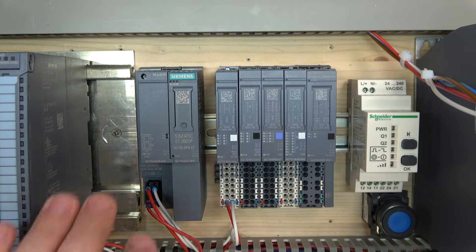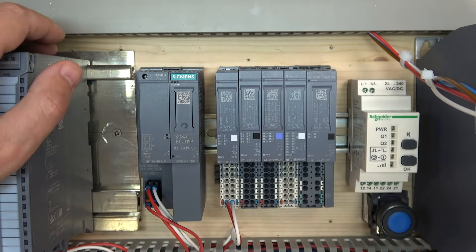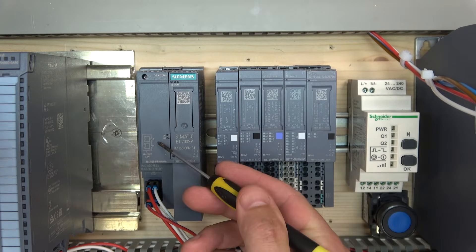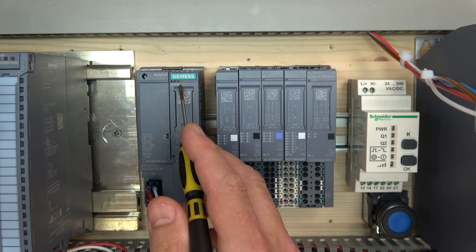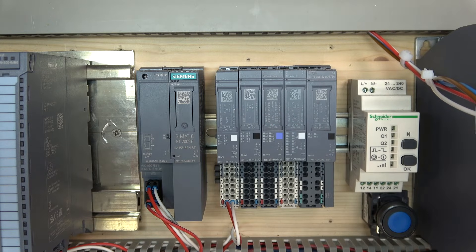Alright, first things first - let's have a look at this unit itself. It fits directly onto the DIN rail problem-free. It usually comes with this Ethernet card when you buy this interface unit, but sometimes they come without it so do pay attention to that. This card has a different part number from the actual unit. It's got a 24-volt connector down there and you can also carry on to the next line from there. You have diagnostic lights, a maintenance light, an error light, and a run light as usual.